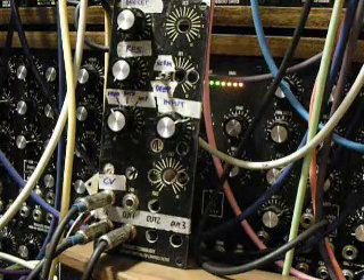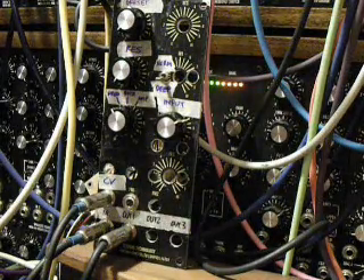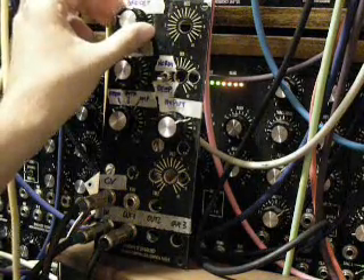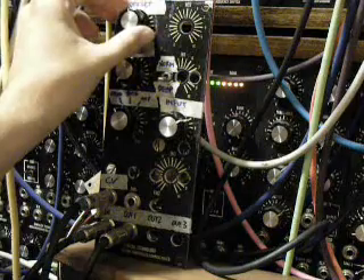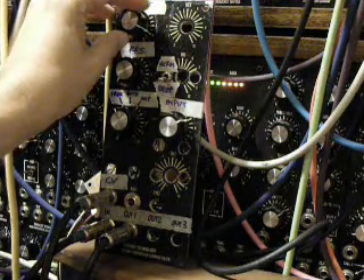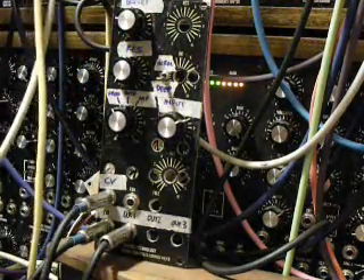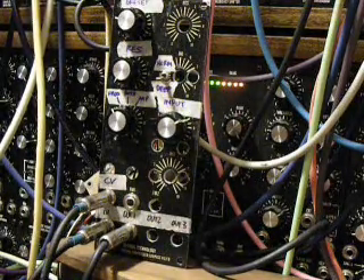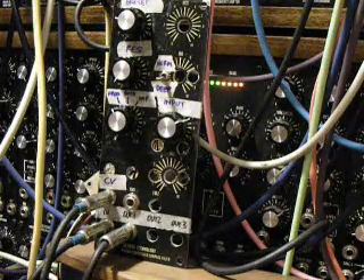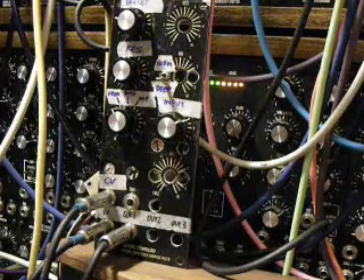Let me go ahead and get through some of the settings here so you can check this out. It does also do amplification, gating on and off, but I really find the slower version more useful as a filter. I'm going to go ahead and turn the offset up here, which is essentially the frequency control. Now it's important to mention in the setup here: there's a VCO being controlled by my MFOS sequencer, and the only CV going into the filter to give that envelope type sound is the trigger from the sequencer. All of the decay is due to the Vactrol, one of the reasons Vactrols are desirable for use in synthesis.